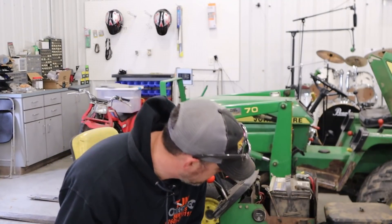I don't think I want to go down the fuel path yet. I know it's got a newer fuel filter on it, but the fuel lines are notorious on these for going bad too. I'm still thinking compression is the issue. This hour meter is showing 1,600 hours and usually that's about all you get out of one of these Onans. Thanks for all the feedback — I appreciate the comments about Bill and what we could do to revive him. I don't know if he's headed for the scrap pile, going to get recycled, or blended in with one of my other tractors. One way or another I've got to do something, because when it's under load it's just too much for the old boy.